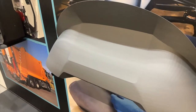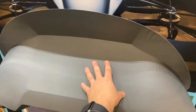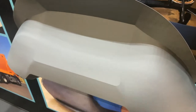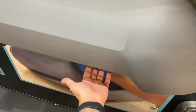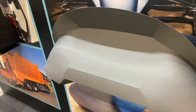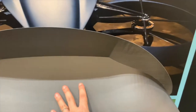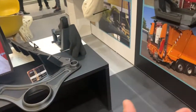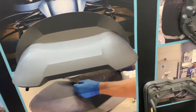We have a lot of experience with carbon fiber laminates. You can bring the molds and directly do cold lamination if needed. The HDT of this filament is 150°C, so you can put it in an autoclave at a relatively low temperature and still cure it. You can increase pressure resistance by increasing infill, or print it hollow and fill it with epoxy-aluminum for extra strength. We also have many customers in automotive parts customization — print the positive as a prototype, use it to make a glass fiber mold, then pull as many carbon fiber parts as you want.